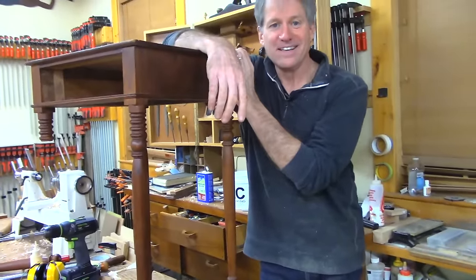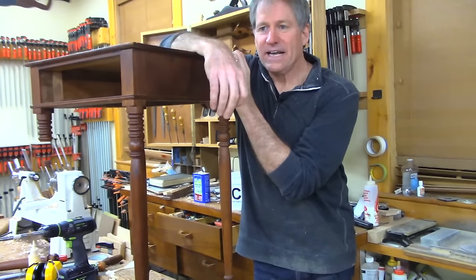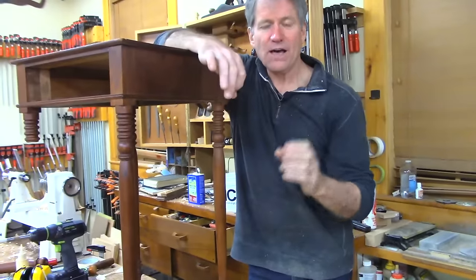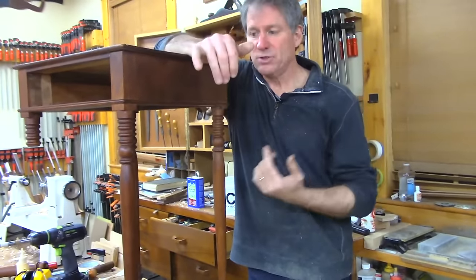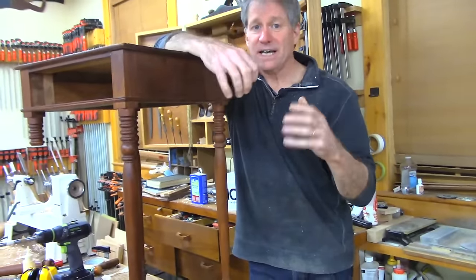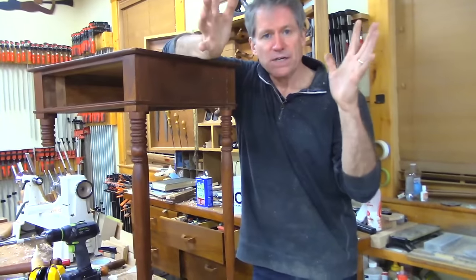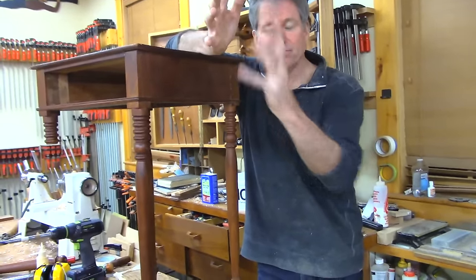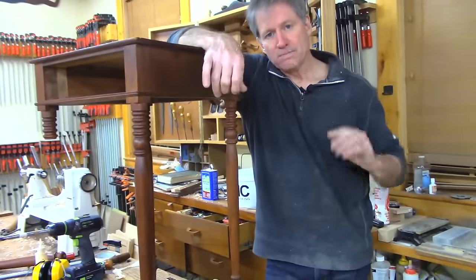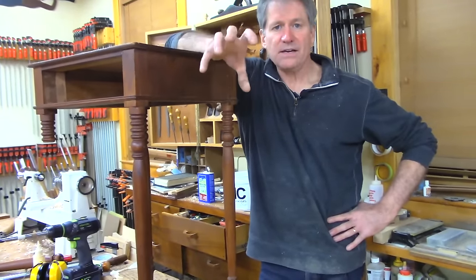I'm very relieved. Danny's curious, is it good to put a groove along the dowel for glue squeeze out relief? Yes, Danny, that is a good idea. It's really important for glue squeeze out when you have like a suction fit. Like sometimes you put in a dowel and you hear it pop when it comes out. That's a really nice sealed joint. It's almost like a piston with a ring on it. It actually compresses air when you're pressing it in, so liquid is even more resistant. So it's good. I usually just make one little V chisel cut up the side, and that's enough to do it on a tight fit like that.